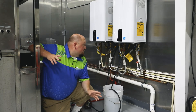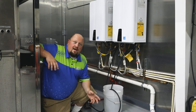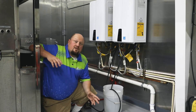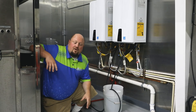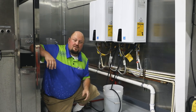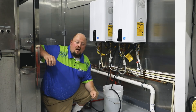In the area that we're at we have pretty hard water, and when we sell tankless units we generally like to install a couple of things with them to help protect your investment — either a water softener or a halo-type water conditioning system. That's what we really like to put behind these to make sure you get the warranty and the longevity out of your tankless system. It's not required, but it is optional.